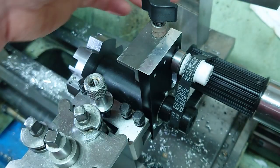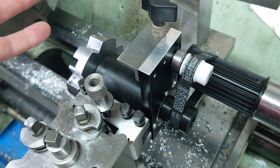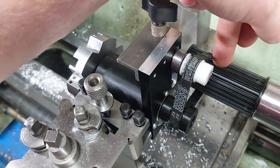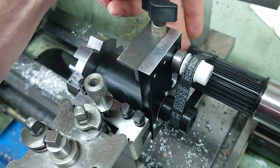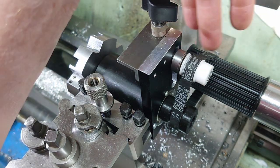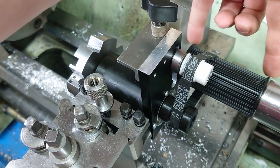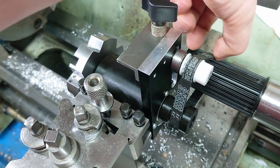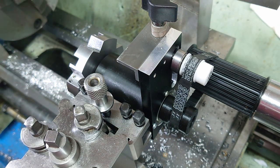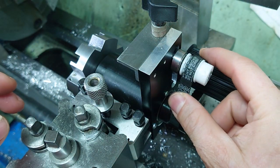I had a couple of people suggest using a keyed shaft and a sliding gear, like a chain drive or something, to get rid of the slipping issue, and I definitely thought about that. In my model, I've got a keyway on this shaft, and I did try to cut it on the ER11 chuck. However, this was too hard for my milling cutters, and I was unable to get the cutter in to do the cut. As I was running out of time, I just 3D printed this long pulley, because originally it was just going to be a normal pulley that slid backwards and forwards, in which case that could have been replaced by a chain. So yes, I had considered that, and potentially could still do that, although I think there might be some mileage in altering the way the belt tensioner works.